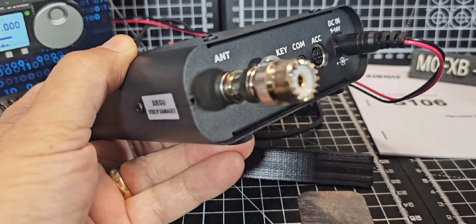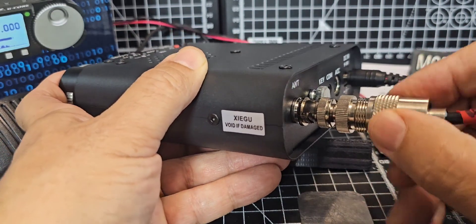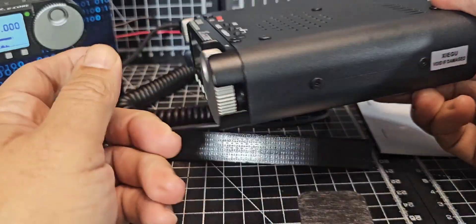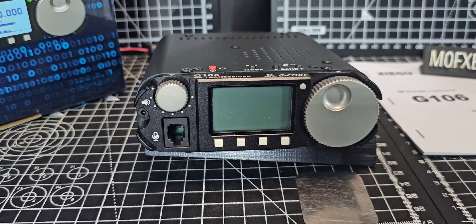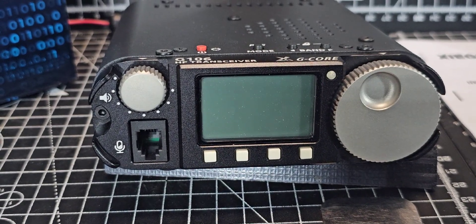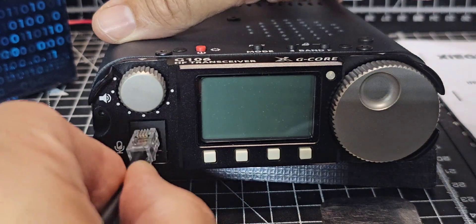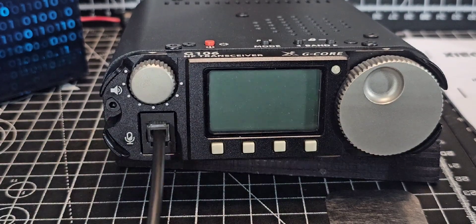We'll get my antenna on there, which is a 49-to-1 balun connected to a 66-foot length of wire about 10 feet up, and then partially along a fence. So it's actually a very poor antenna, but normally in Europe we will get some good contacts. Remember, the antenna is really crucial to getting good results — it's not about how much money you spend, it's always about the antenna setup. So do some learning on that. Now I've never used this device, so I want you to know I'm learning with you.